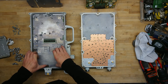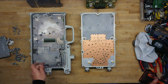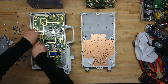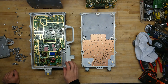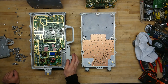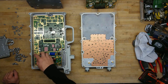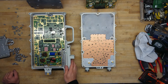Let's see the system unit. Power supply is at the bottom. Up here we have the two transmit outputs to the power amplifier, so we would have all the digital-to-analog conversion sitting around here. As we have the receiving inputs down here, we probably have all the analog-to-digital conversion over on this side. And the back side of this board is the main CPU.